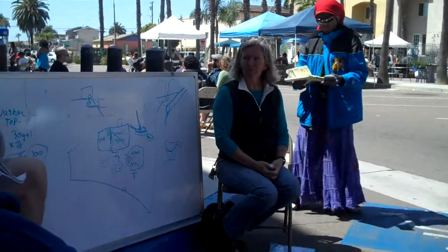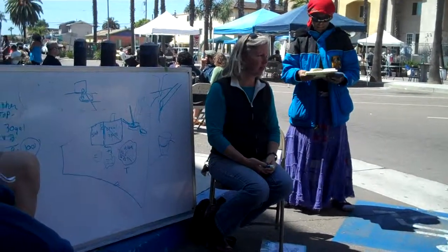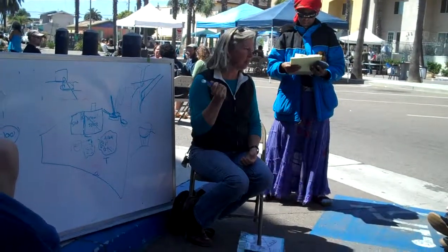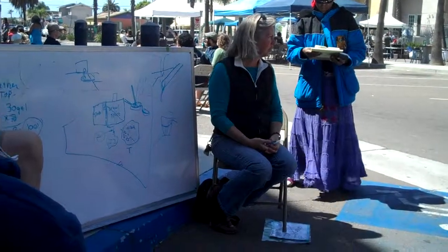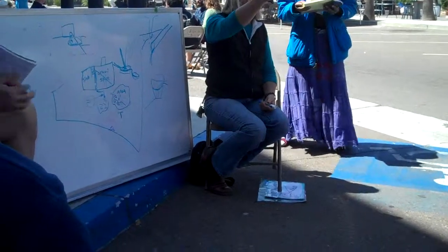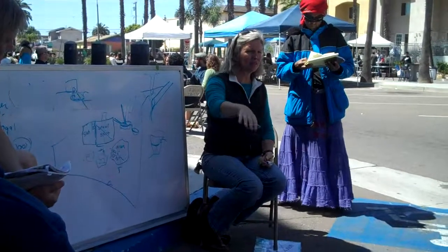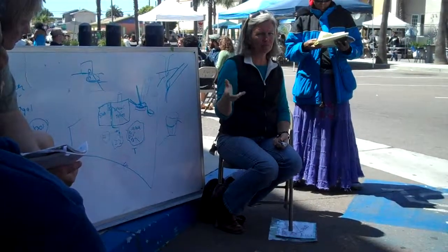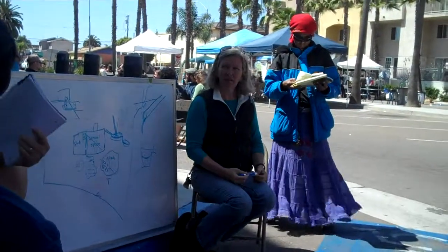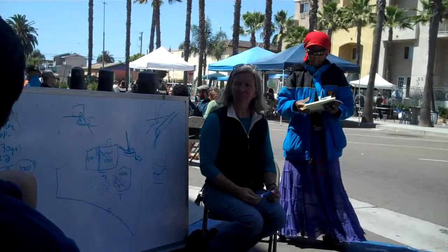That sounds pretty complicated. It's a little complicated. I have plumbers that I work with that are journey level plumbers or contractors. When you get into the shower system, it's a little more risky. See, with the washing machine and having the visible valve accessible right there, that's easy to do. But when it's a shower system, to make that valve accessible, either a trap door or going in from the outside and through the access panel on the outside of your house. Which isn't good.